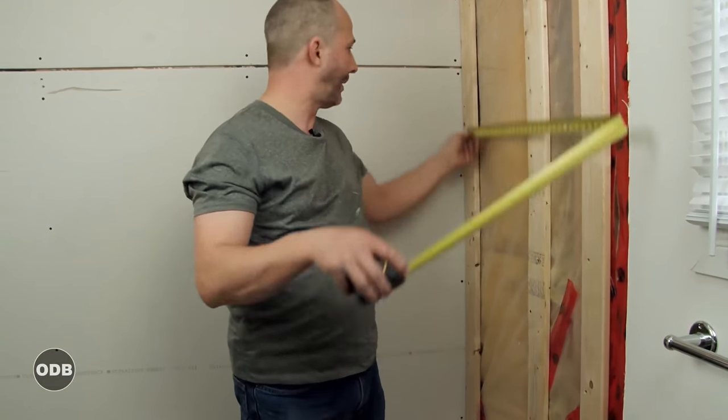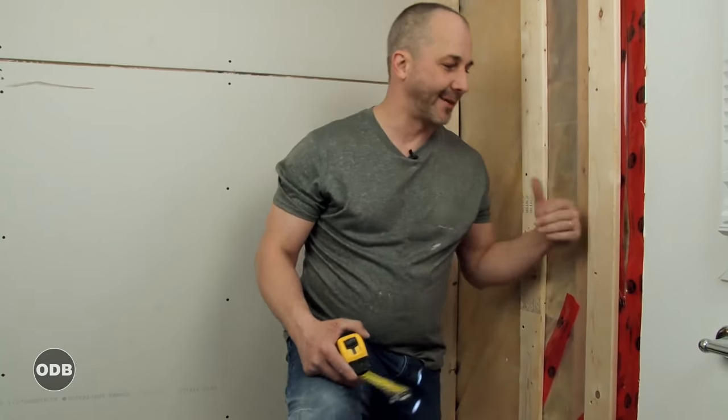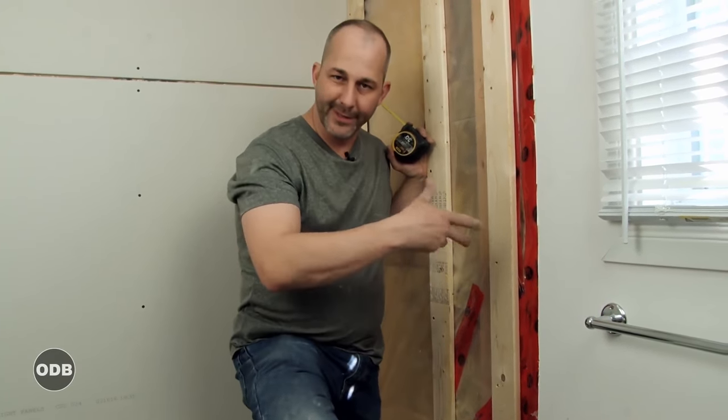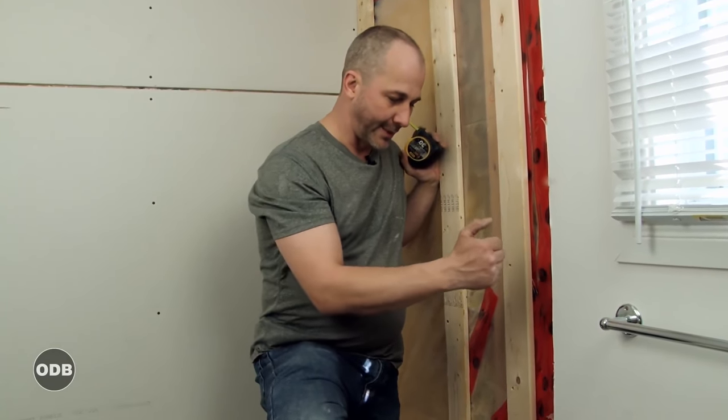This is a 33.5, that's fine. Because we're building this out, the new drywall won't meet up with the old one. So I picked up a piece of metal J trim molding. You'll find that in the trim section for drywall, where you get your outside corners and inside corners, U-channel, that sort of thing. So this one actually wraps the drywall on three sides.